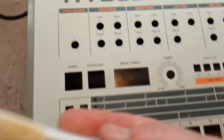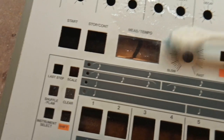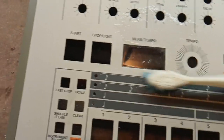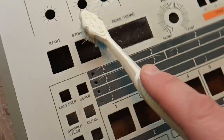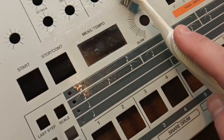I also made good use of baking soda when cleaning the front panel — nothing else seemed to work. Alcohol got rid of the old tape glue residue, but most of the other dirt stayed. Baking soda did the trick. You do need to be careful around the display window, though — baking soda can be slightly abrasive and would scratch it.